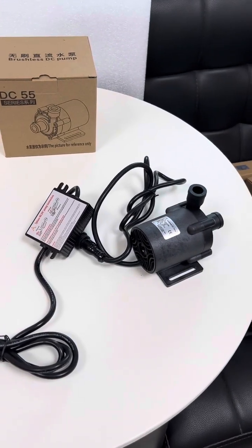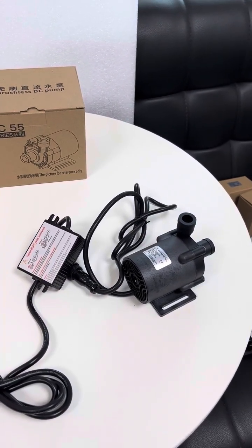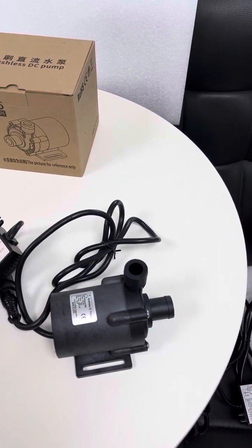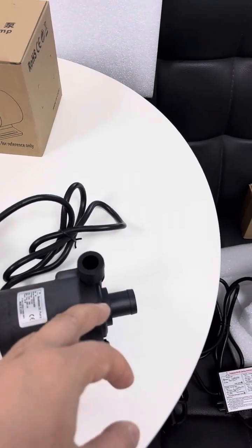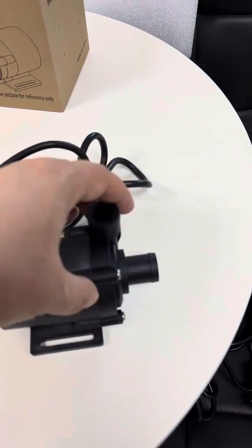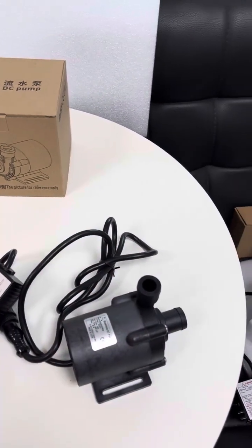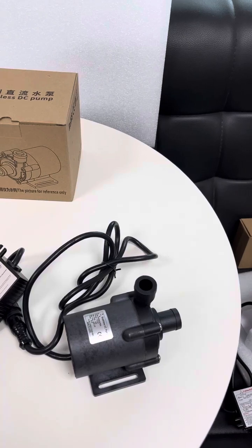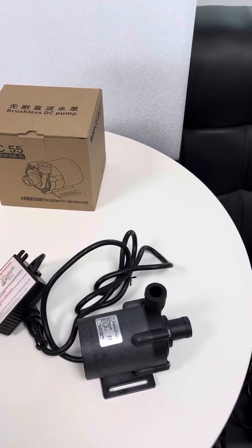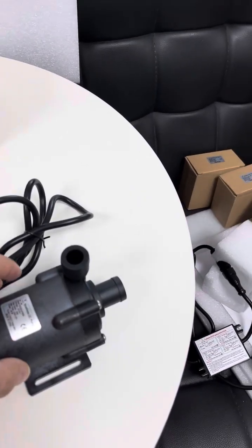As a whole, this pump has good lift value, pressure value, and works with stable, low-noise performance in normal circulation, pressure, or cooling systems. However, this pump cannot be self-primed. It works by high-speed rotation of an impeller inside to push the inflow out of the cavity. We should still let this pump run with sufficient inflow and not let it dry run for a long time, even though the protection mechanism is integrated.